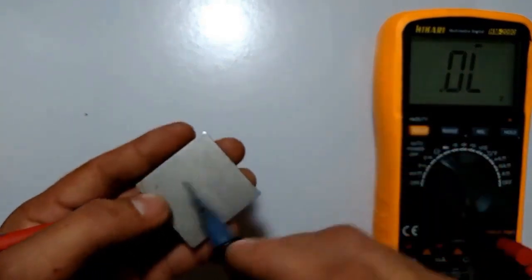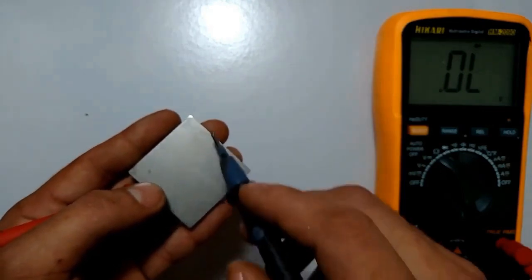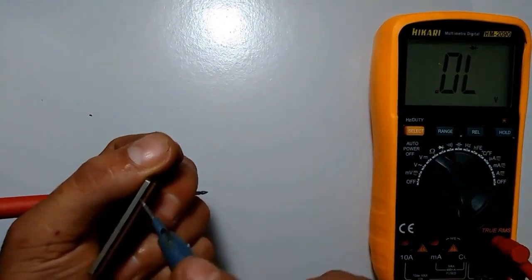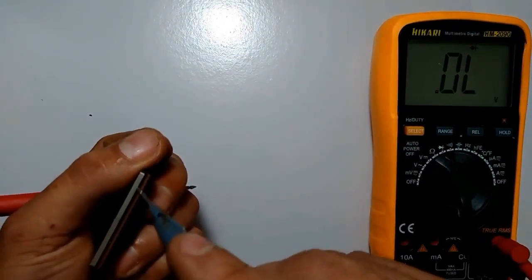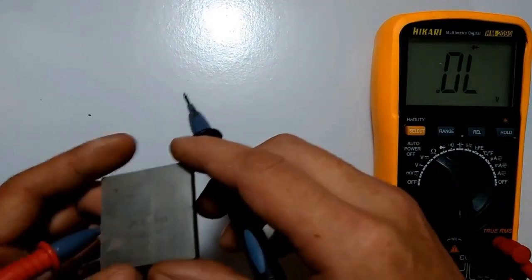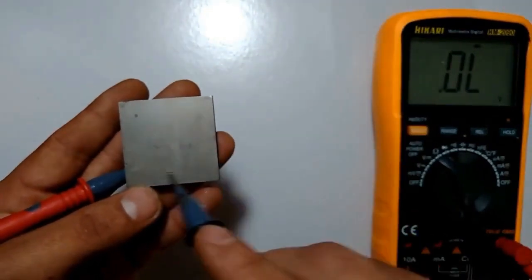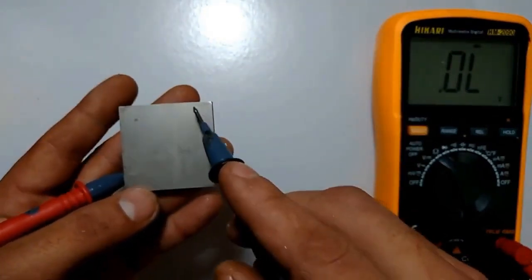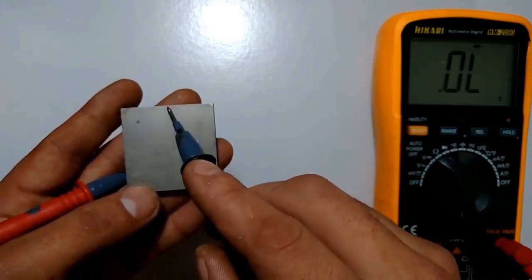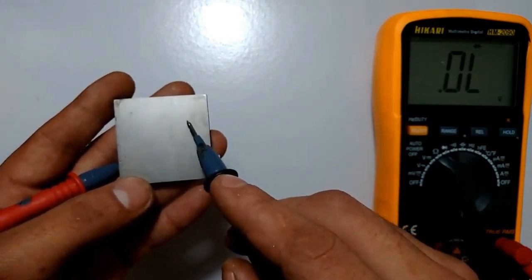Sometimes you will apply heat to remove it from the board. Even if you remove the IHS here, you have to be careful not to blow too much hot air from the top because the memory is attached to the graphics processor. What happens? I don't have any graphics processors without an IHS because I didn't prepare them. But it has 4 memory chips here in the corners. Those who work with this already know. These memory chips are soldered on top of the processor, and then a kind of adhesive is applied on top that seals it well. So, what happens?